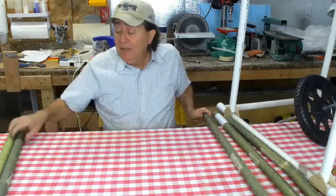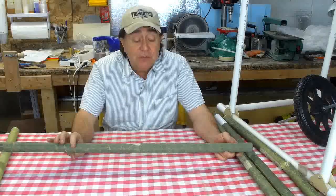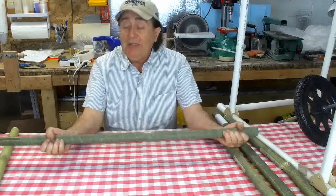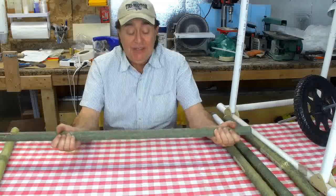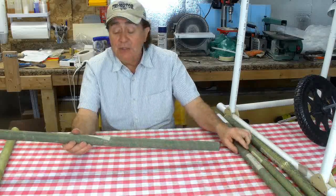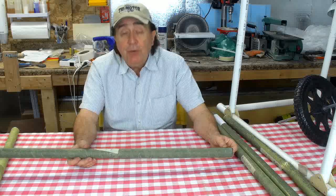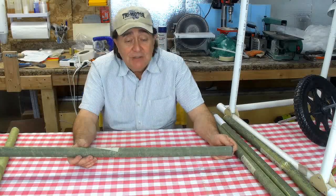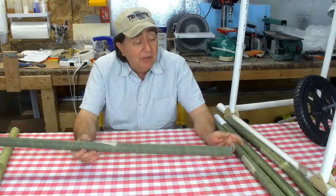So I thought, okay, let's just add one more layer of carbon fiber. This has 3 layers of carbon fiber, 1 layer of Kevlar. This is now plenty stiff in compression. I can still do it a little bit like this, but it's plenty strong. Rounded off, 0.9 ounces per foot, 1.27. So this is 4/10 of an ounce heavier per foot, times 20 feet, so you got 8 ounces heavier. So we're carrying an extra half a pound to prevent local buckling.